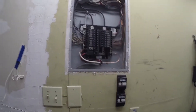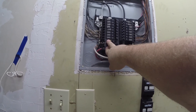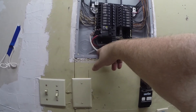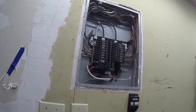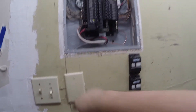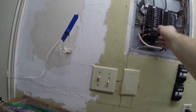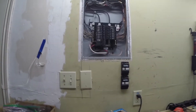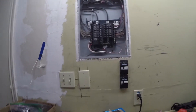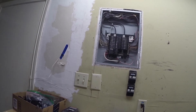Alright, as you can see the breaker is off and we got everything wired in. Let's talk about what's going on here. This main connection is sending two times 120 — 240 — out through this red and black wire down to this plug. This is our neutral wire, and you can see I had to split it up into some of the threads of the wire because the holes aren't big enough. This is our ground, just chilling down here. Our wires come out here and we're already putting a plug — I can just take this cover off, put on a plug, flip the circuit breaker on and then we have power. All we have left is really just to punch out the holes for the breaker and the panel and we're good to go.